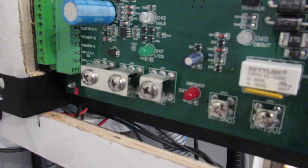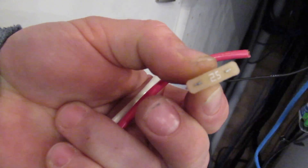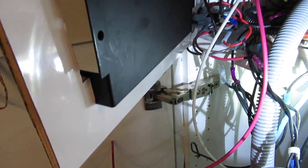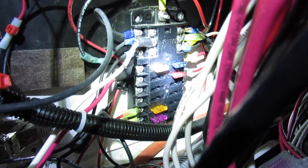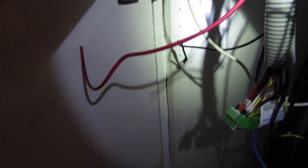We're going to hook up the power now right here and put in a 25 amp fuse — that's how much the system wants us to use. We'll hook that right up to the block back there. There's a 25 amp fuse on that line, and that goes to the ground — we'll just pop them in the bottom.